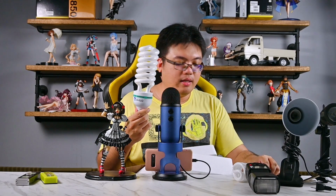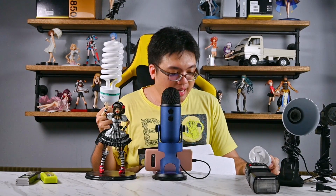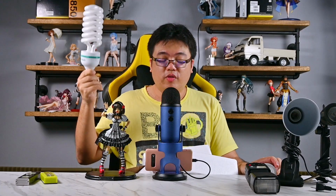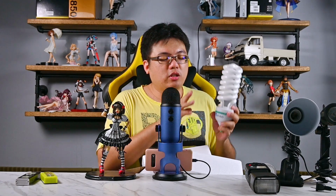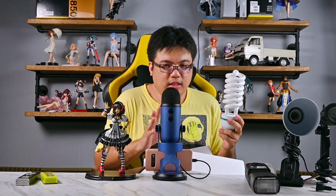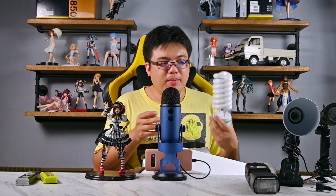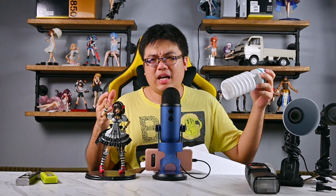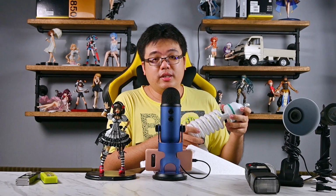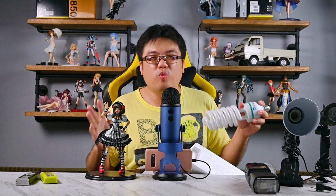So what is the difference between a professional grade and a consumer grade light bulb? Other than being bigger and brighter, obviously, the color temperature, right? So one of the main advantages of professional grade light bulb, this is not something you put on your ceiling for your room lighting, right? This is for photography and videography, but I'm letting you guys know anyway because this is extra knowledge for you guys watching this. So the beauty of professional grade light bulb is that the color temperature is very stable and constant throughout its entire lifespan, right? From start to end until the day it dies off, the color temperature is relatively stable. So if you use this very same light to light this figure for photography, the figure will turn out looking more natural. It won't have these weird colors on the skin and so on because the color temperature is very accurate, around 5600 kelvins, which is near pure white color, right?